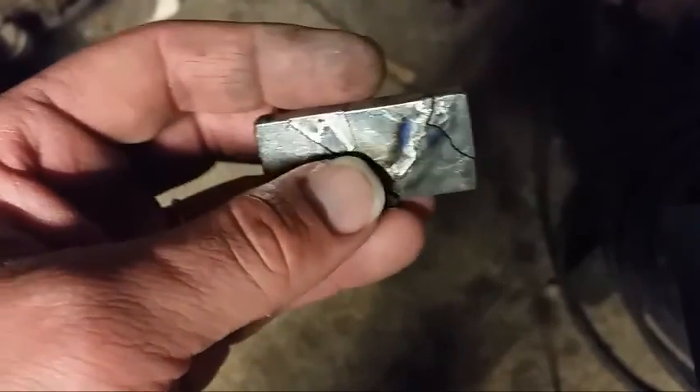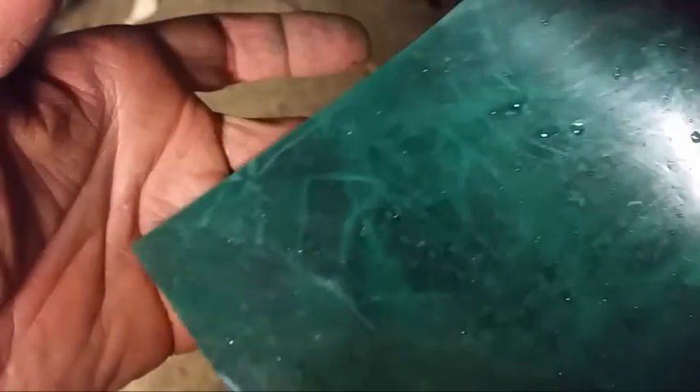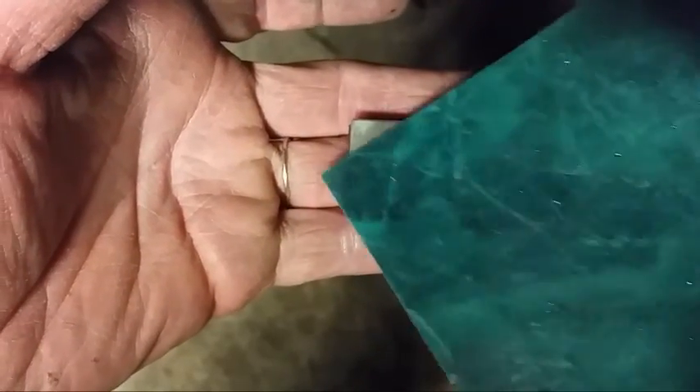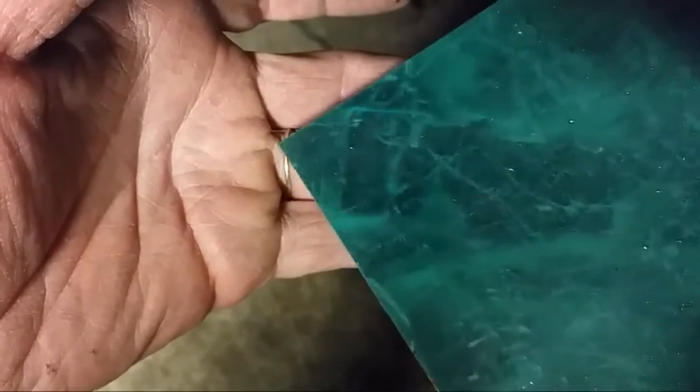For the next one, the rectangular: it was lightly hit and it came out in pieces. Pretty much the piece that fragmented off was the piece that still has the field. So, you can't really draw designs into a magnet with a flame — it's just too hot. Seeing that the flame was around 3,000 degrees or so, there's kind of a light distortion there. It didn't crack there, but the field ended there, so interesting.